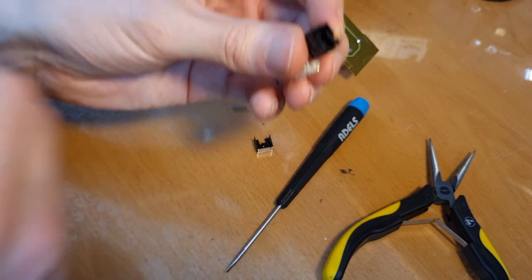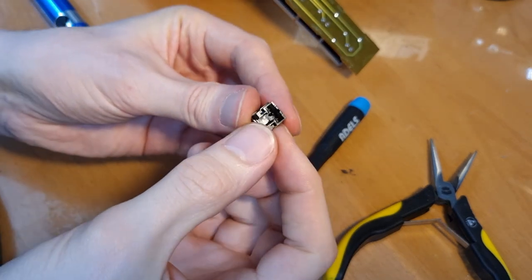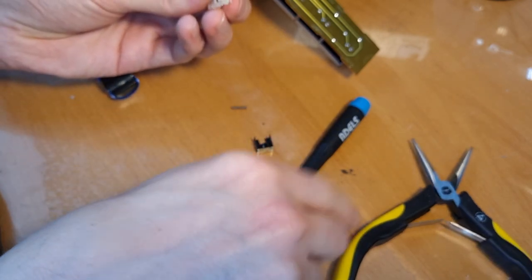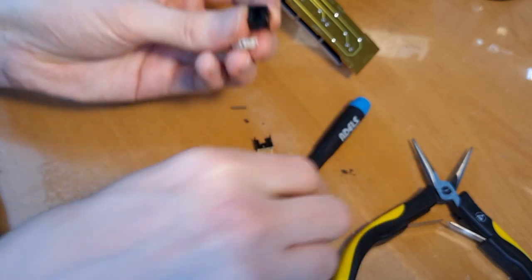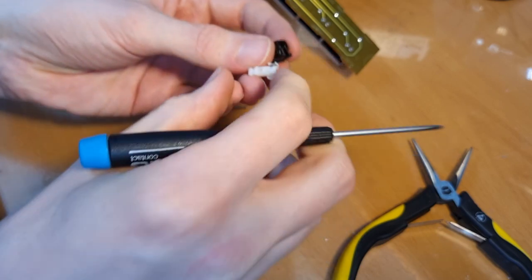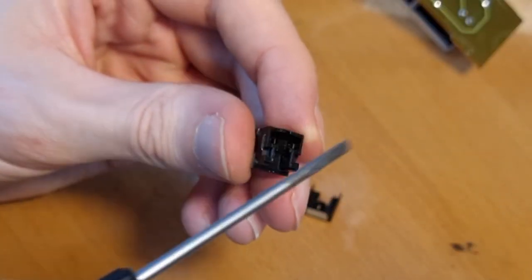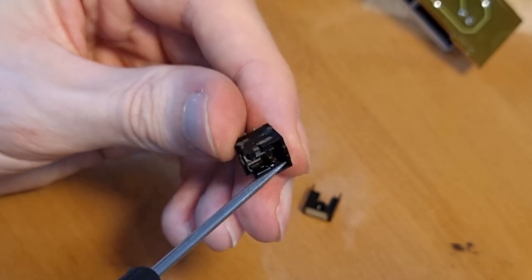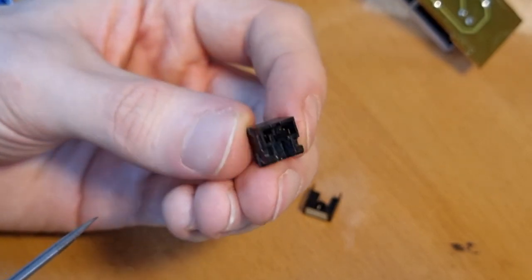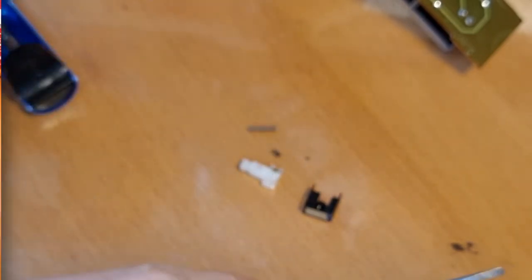Okay. See, so I'm not checking the camera here. I don't know if this was in shot, but I'm losing the contacts here of the switch. So see, you have 2 contacts here. That one just fell out. Here you also have 2 contacts. I'm simply going to clean these and then assemble the switch back together and see if it makes a difference.